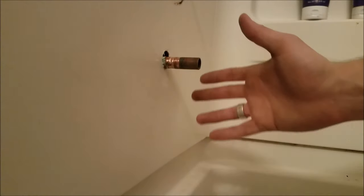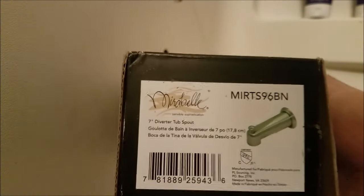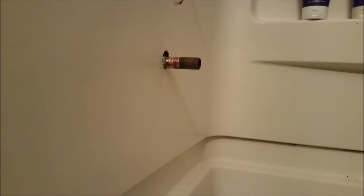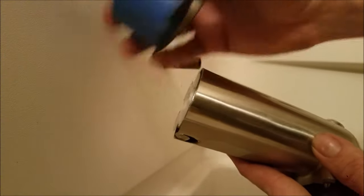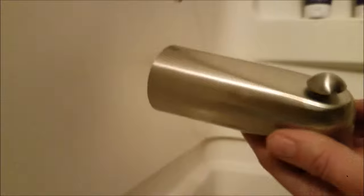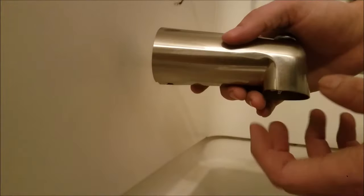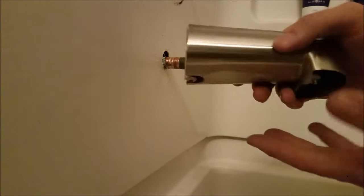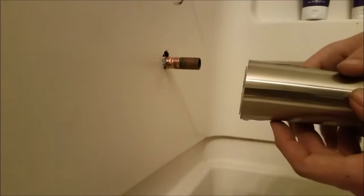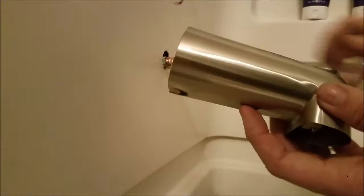Now we're ready for reinstall. I cleaned the caulking around here and cleaned any metal shavings around the drain. This is what I'll be replacing the original unit with — this Mirabelle 7-inch spout. I actually took that 7-inch spout and cut an inch and a half off. I just had it wrapped with painter's tape to protect it, marked it evenly all around, and cut it slowly with the Dremel. I know they make various sizes, but I picked this up for $2 — somebody installed it and thought it was too long, which in fact it was.